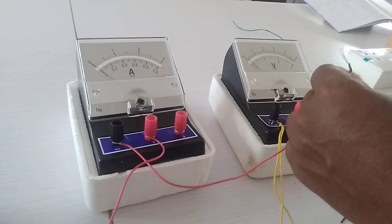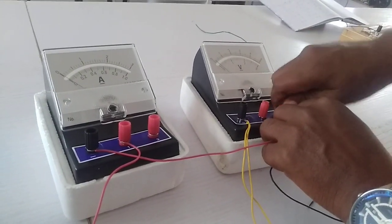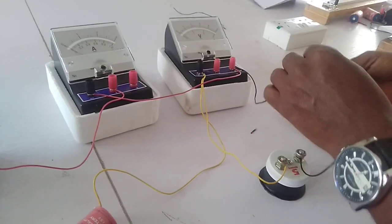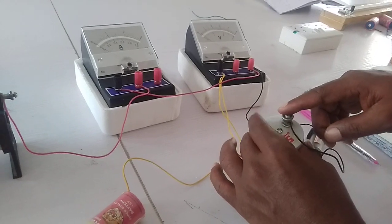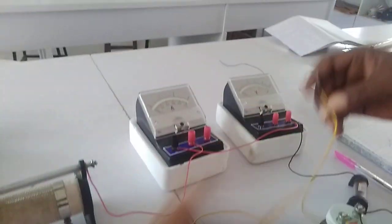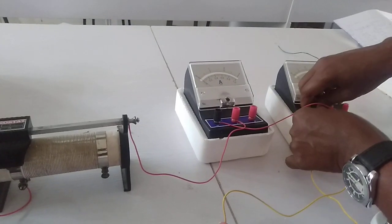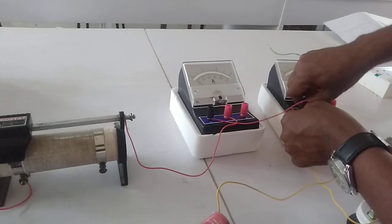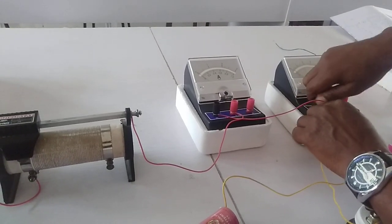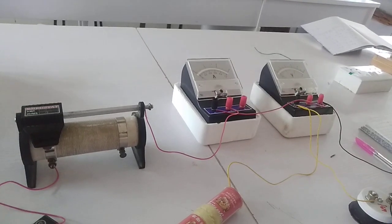Since we are connecting the resistor to it, we connected two cables to the positive of the voltmeter. The second cable we now go to our resistor — one end of the resistor we connect another cable from the second end of the resistor to an end of the second resistor. From the second end of the resistor we connect another cable together with the negative of the battery, and these two cables will now go to the negative of our voltmeter. So what we've done is connected the two resistors parallel to the voltmeter, while our ammeter is in series.